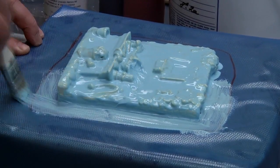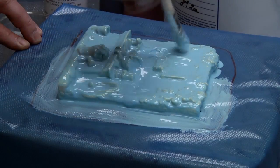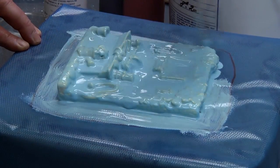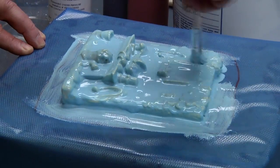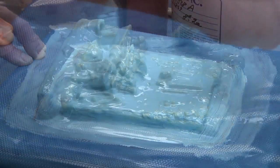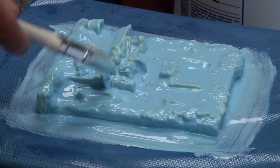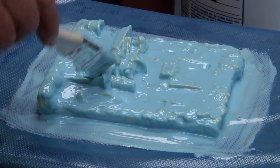This is your flange. This will help complete the first coat, which will sit for a one-hour period before applying the next thicker coat. The rubber itself will still take 24 hours to cure, after which we will make the plaster mother mold.